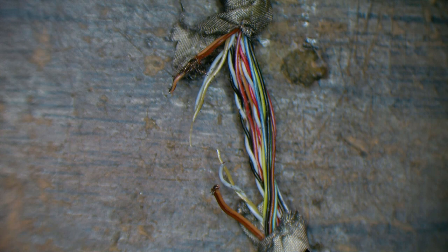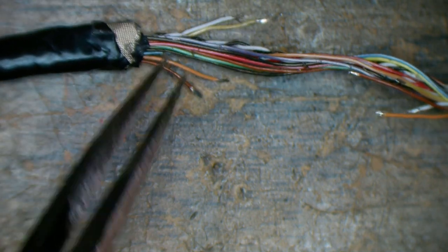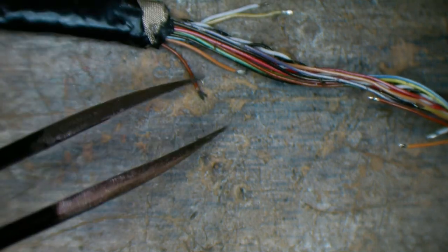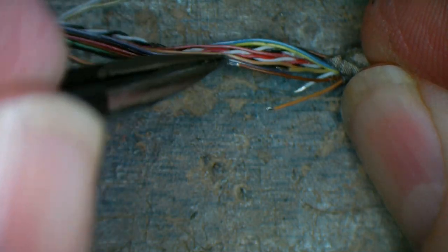Not a hard job, just a pain in the butt job. What I do in instances like this is trim them at different lengths - the yellow one is the longest, then the white one, then the brown ones - so they're staggered, making it easier to insulate them when we wrap it all back up. If they were all at the same length all the solder joints would be beside each other, and the solder joint being a little fatter than a single strand can pack out that area too.